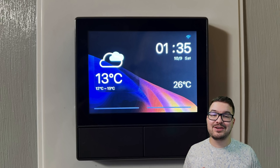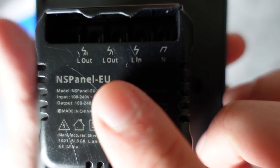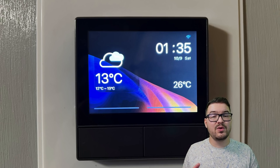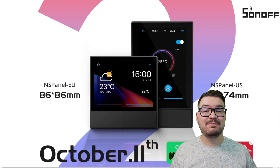The panel connects using Wi-Fi and utilizes a 2.4 GHz network connection with the 802.11 standard. The panel has two 2-amp relays which are controllable via the four interaction methods we previously spoke about. As it's only 2 amps, you're only going to be using it with lights — you won't be hooking up big electrical loads or machines.